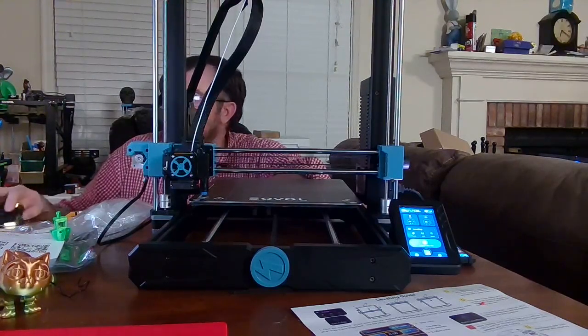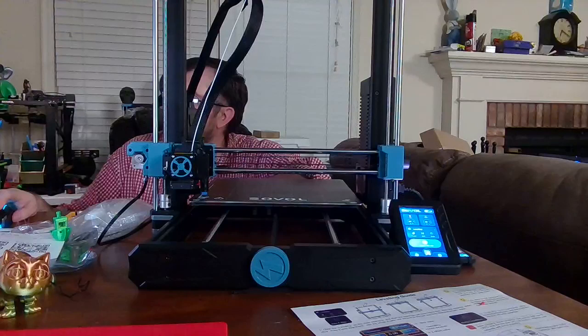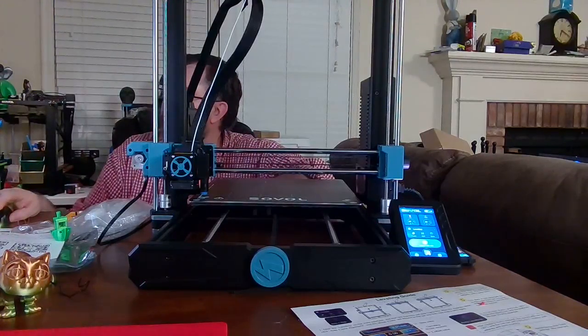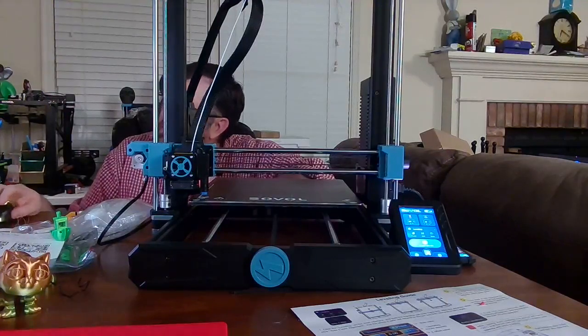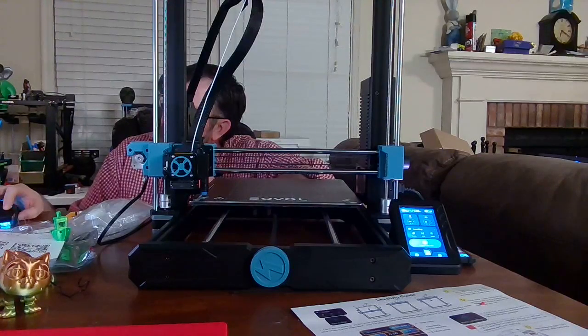There's my 3D Benchy. Put it in there. I don't want to do too much infill. Let's probably like, I don't know, 5%. At 0.2 layer height, yeah, that's fine. Wonder how it would do with my fast profile I have made. We'll just try this first, I guess. Speed is still 150. Wonder how much stringing will happen without changing any of that.